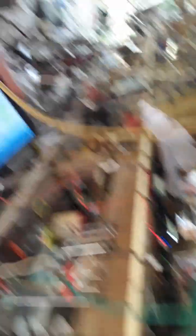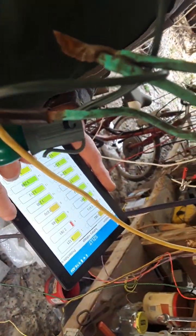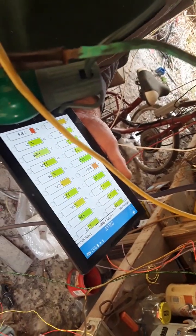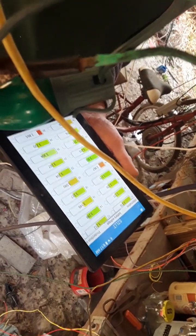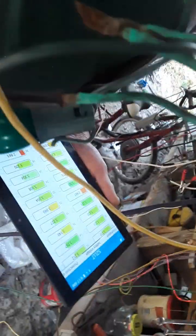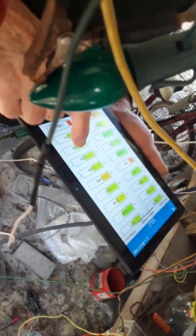This pack has voltages all over, so it would be tough balancing this one. If you're 10 amp hours out of balance and you're balancing at 200 milliamps, that'd be about 4 amp hours a day — so in two days you'd balance it out.